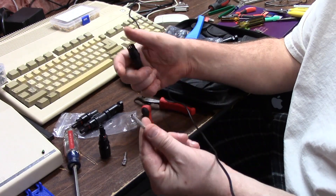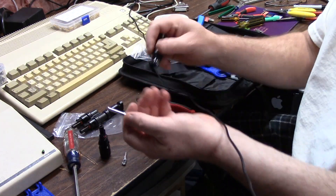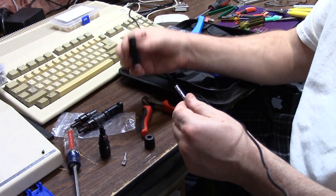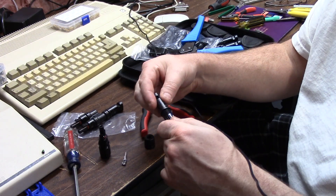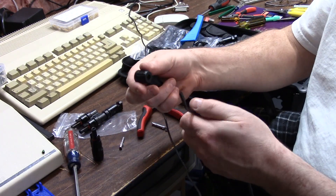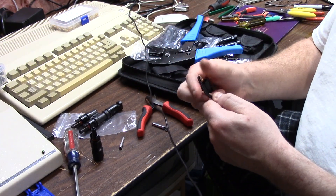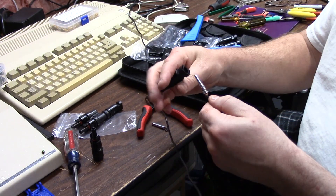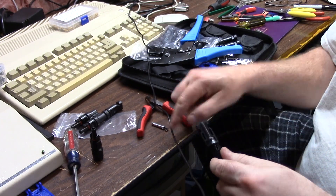Once it's crimped, you'll have these two pieces. Put the crimped tip into the connector housing — you can slide it over your wire a little bit, even hang it off your wire. Push this piece through the threaded end, down and down, and it'll click — you shouldn't be able to remove it easily. But do not forget to put the barrel on the wire first, before you tighten it down and click your line. Don't forget to put this on — that really sucks to miss.